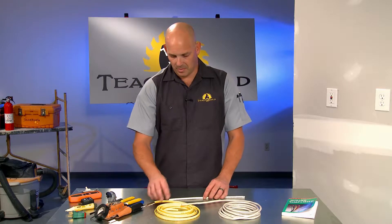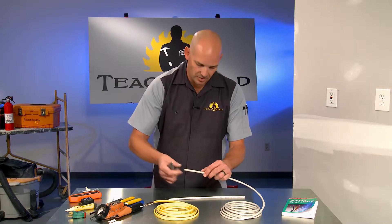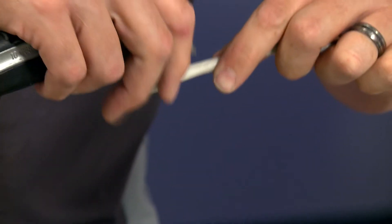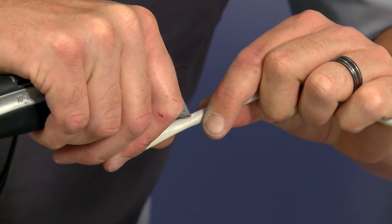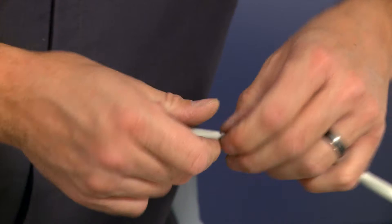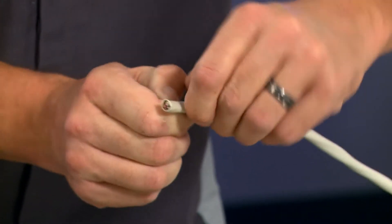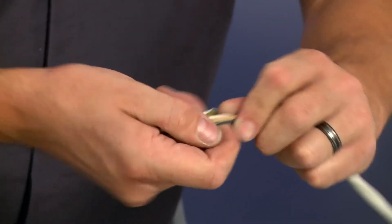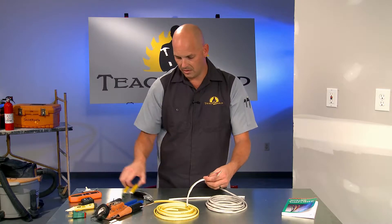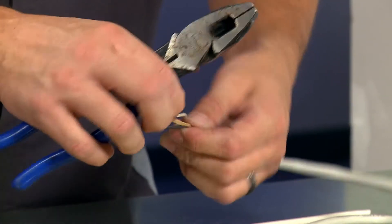Stripping these is just the same as stripping. The 14-3 is a little bit of a challenge because you still need to use a razor knife. You need to find a place between the wires to the best of your knowledge, make a shallow cut that will allow you to peel it back and get it open. Once you've got it peeled back and open, you need to make sure you didn't penetrate any of the insulation on the neighboring wires. As you get that torn open, eventually you'll be able to get it far enough up where you can peel it up off the wire. Then by holding the wire and pulling, you can remove the insulation down to where you need to. At that point, you can use a pair of wire cutters — I'm using lineman's pliers in this case — to cut off that extra insulation, and then you're ready to go.